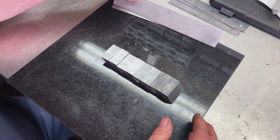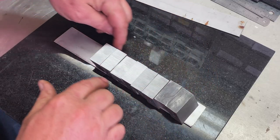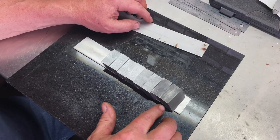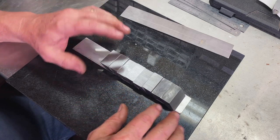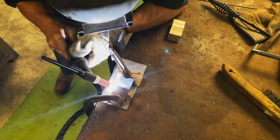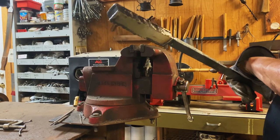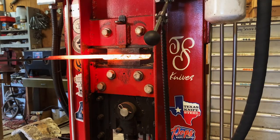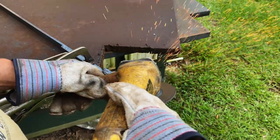The next thing I'm going to do is put them on this sheet metal here. I use a piece of 316L stainless — I'm just going to fuse weld everything to these sheets and then fuse the sides. I'm not going to be using any filler metal, just the TIG torch, just fusing. After the forge weld I will come in and cut this sheet metal off and draw out the billet. So now I'm going to go tack everything down, get it straight, and get it ready to forge weld.